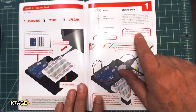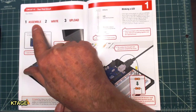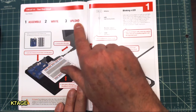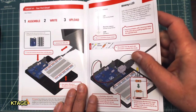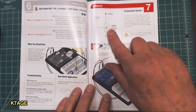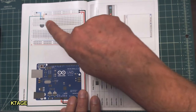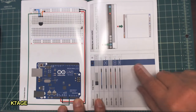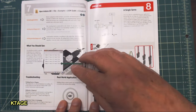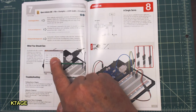The first program that everybody does is to blink an LED. This gets you able to use the IDE — you have it loaded, you're able to load in a software program or a sketch, and then upload it to the module and see the LED blink. Then you can vary the parameters with the delay. Playing with the temperature sensor — that little transistor-looking thing — you hook it up per the breadboard diagram, open up the sample sketch in the IDE, and on the serial monitor you can see the voltage from the sensor in degrees C and F.